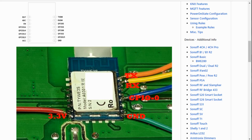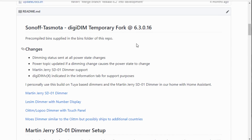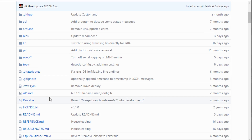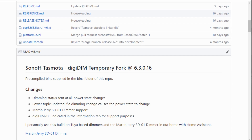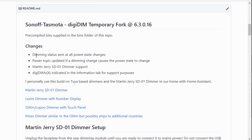If you tin the wires and put a little tinning on the pads, then heat and pull them together, it's really simple. I have a temporary Tasmota fork at version 63016 with a couple of changes — source code is available if you want to compile it yourself. We use this in my kitchen every day, so it definitely works. There were several scenarios where dimming or state wasn't publishing correctly depending on how the unit was turned on or off, which required changes in the template.